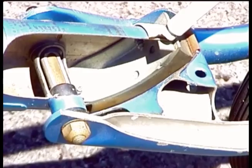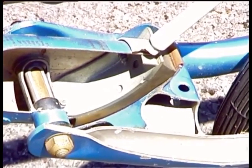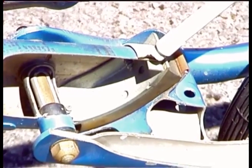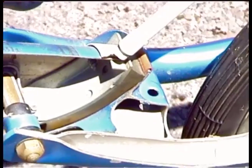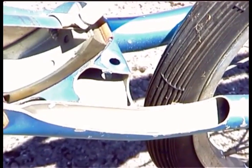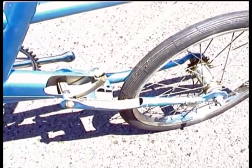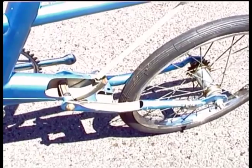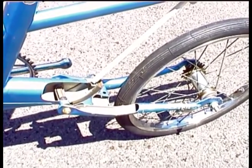See the suspension pivot there at the bottom left of the picture? The suspension is moving in quite a different arc to the way the rubber is disposed, so that it's being sheared and compressed at the same time. You can also see a bit of the construction there of that rear trailing arm. And let's just move back a little bit, see it all in context there. So a nice little look there at the inside workings of the original Moulton suspension.